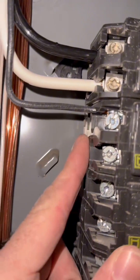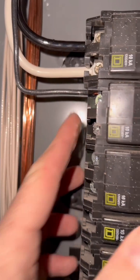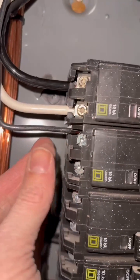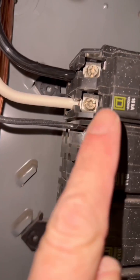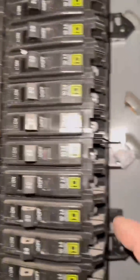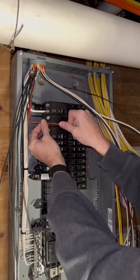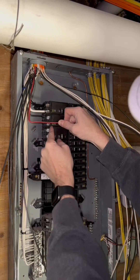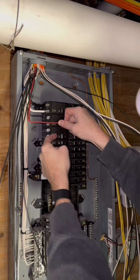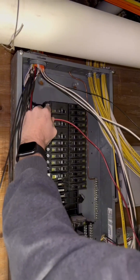Make sure the copper never extends past the black insulation right here — if you've got copper exposed out there, it needs to be redone. One more tip: when you're putting these in the screws, you always want to put them in as the screw tightens. See how that's stubbed in on the top? The screw tightens this way, so on the other side it's going to go in at the bottom because the screw tightens that way. When you're trying to figure out where these wires go, set the 90 right where it'll line up, and then this edge on these Square D breakers — where the panel cover rests, right at the end of the 'D' — that's where you cut these, and it'll be perfect every single time.